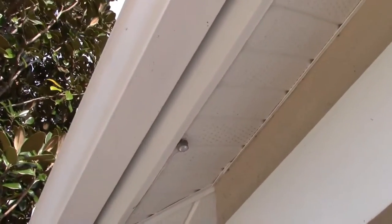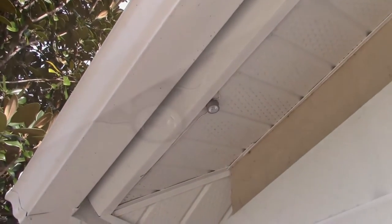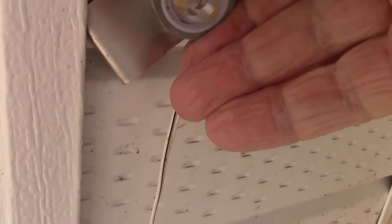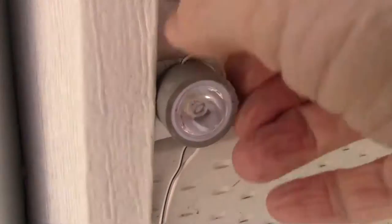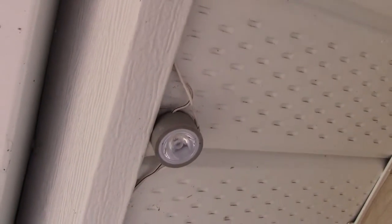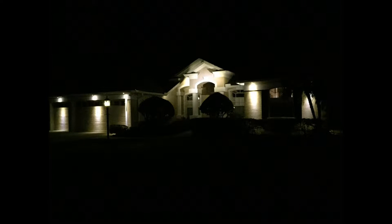There's what one of those holders looks like already installed. The metal flashing is just bent over and I'm able to stick it up in here and it holds itself. I tuck the wires up inside, and all is well — no fasteners, no nothing. It's all held in with friction between the aluminum fascia and the soffit. Here's a shot taken with my iPhone after dark of the house and how the whole project looks. It's interesting to note that I'm running the LEDs at about 125 milliamps, on a part rated to run up to 750 milliamps — just about one-sixth of rated power. That produced adequate brightness, but if you want more, you could put four LEDs in series instead of five, which would run them at around 400 milliamps, about 53% of full power.